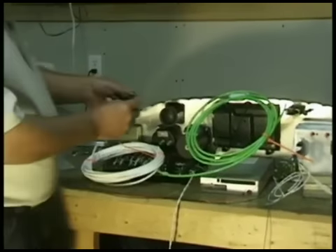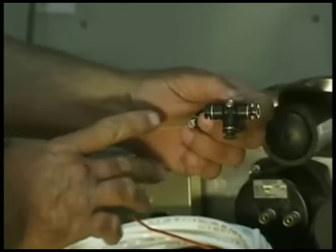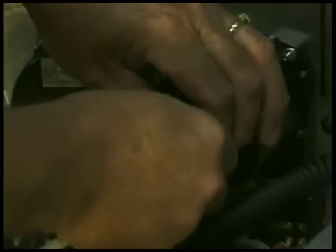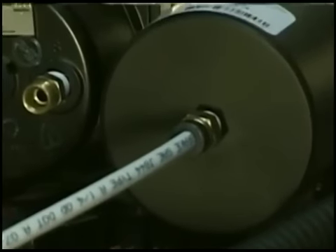I have on my kit a complete drop-down system. I'm going to have a little rail along the back inside my cabin, and I have T's. The line will come in — both the pitot and the static — it'll go to the next instrument and will also have a drop-down. Pull the line out, put the line in — that's how fast you can do your whole vacuum system. That's in there, it's tight, it's not going anywhere. Your panel will probably look a lot different, whether you use quick connectors, a homemade bus system, or several different types of buses. This one actually has two built into it — you could have three or four dual battery redundant systems. These are all things you need to decide if you want to add those features.